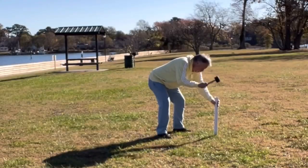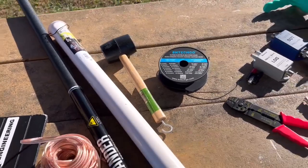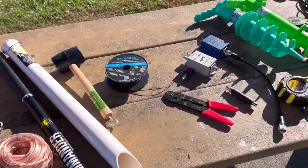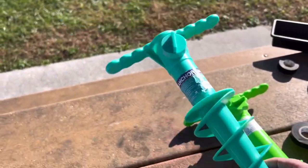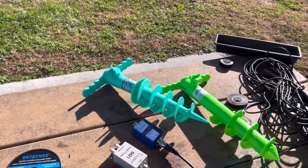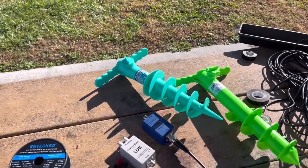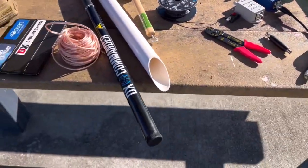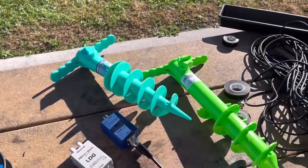I'm going to put it up on my little 7-meter DX Commander pole. This is a surf rod holder — I use this in the ground, knocked in with a rubber mallet. It works in earth as well as sand. I also have the Anchor Away beach umbrella holder — I have a couple of those. They work on earth as well and are great for holding up poles, although they work better with 5-meter poles than the 7-meter DX Commander.